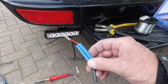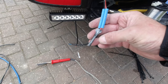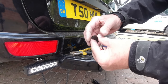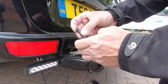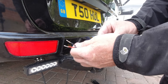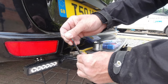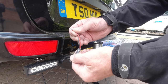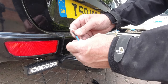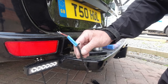Those two will be thick enough to take the three wires when they're all soldered together, but I'm going to put another big cover over the top as well. I'll slide one over this first and then over the other connecting wires to make sure I can shrink wrap it all together. These are the bigger ones, and as I say the key with this is remembering to put them on before you solder everything together — because you'll solder it all together and think 'oh, bloody hell, I forgot to put the shrink wrap on.' You need to hold them some distance away from where you're soldering so they don't get too hot and shrink in the wrong place.